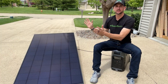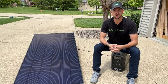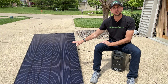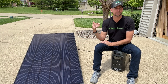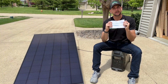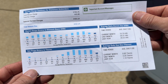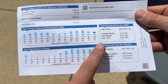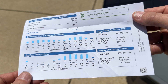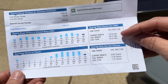We need to understand this because solar panels are usually denoted in how much power they can produce. This is a 360 watt panel, or 0.36 kilowatts of power. And when it comes to your power bill, you'll usually have a trailing 12-month bar chart that shows you how much energy you consume each month, because you need to know the average energy consumption to make sure you're sizing your system correctly.